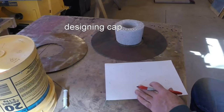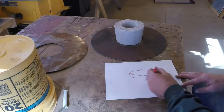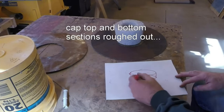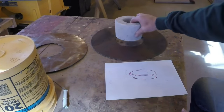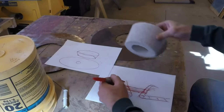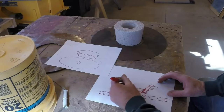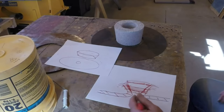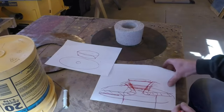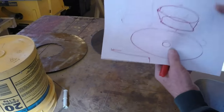What I propose, and we'll see if it's going to work, is that I make a little ring, and it doesn't have to be pretty, not going to be as pretty as my drawing, and my drawing's not great, but I make a little metal band, like so. I've got it in 3D here, that this thing will just fit into, but maybe push that wool through this and up and over. Then I use this piece, and I just fit this piece down in here, against the wall, shoving the wall up against the metal, and this is what I end up with, is a piece here that then locks the wall in place, which is what needs to be done, and also holds this thing from falling down into the fire. Now, if that isn't clear, I don't know what the hell is. So, you know, what can I say? Anyway, that's my plan, and let's see how this is going to go.